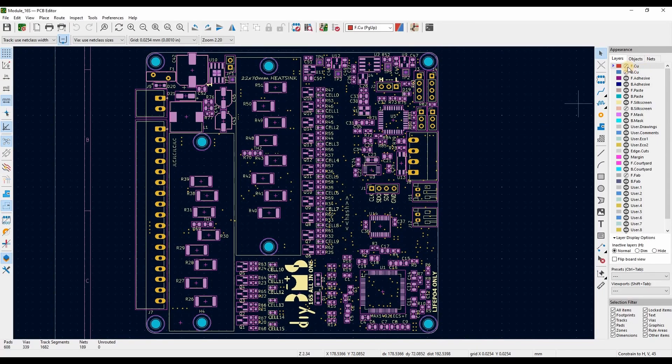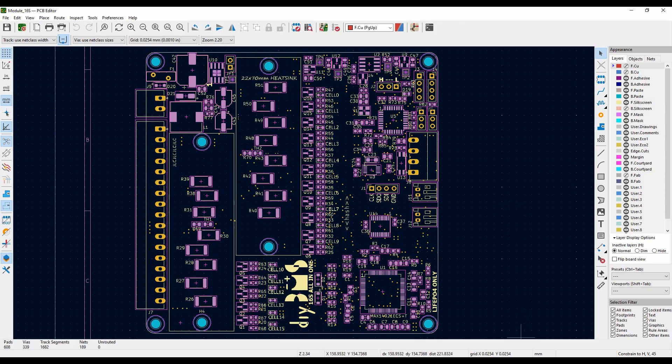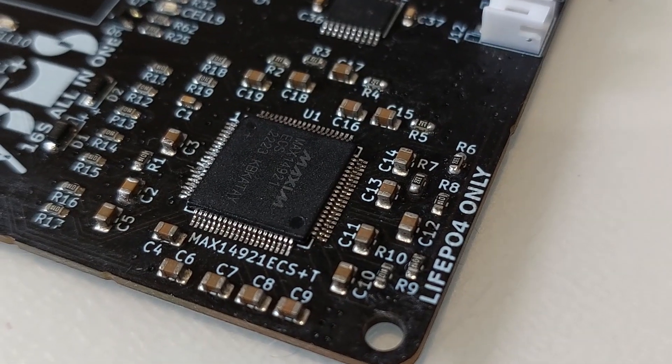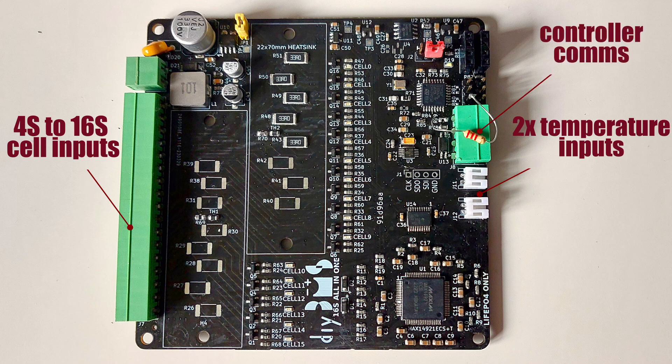Here's the very first working prototype. I think this is probably the most complicated circuit I've ever designed and built. The prototype uses a two-layer PCB but I'm planning to shrink this down and use a four-layer board for the next revision. I've made the conscious decision to design this board purely for LFP cells. This design supports between four and 16 cells on a single board. Two external temperature sensors are provided which use the same cabling as the existing modules. I'm also using the same communications interface back to the existing controller. This all-in-one monitoring board can also be daisy-chained just like the existing modules to support multiple battery banks, all linking back to the single controller.